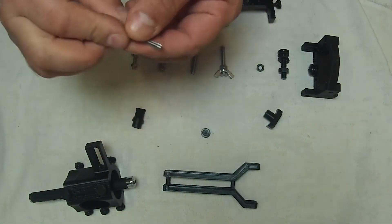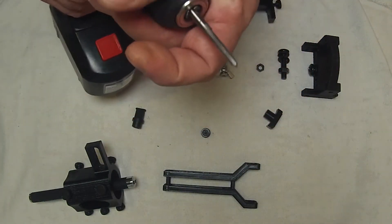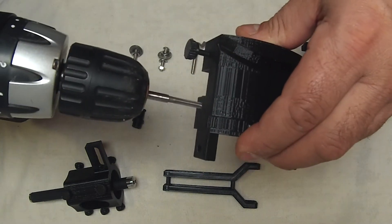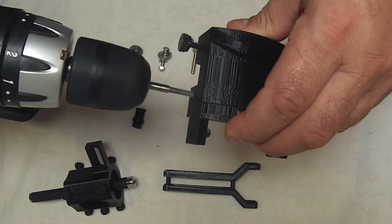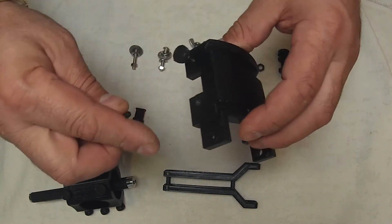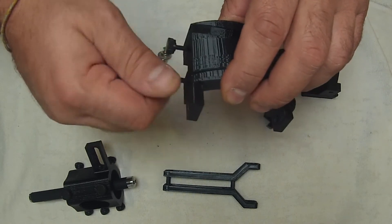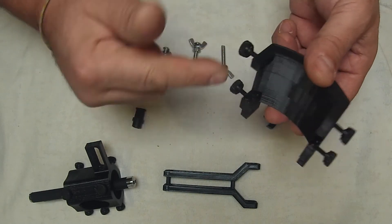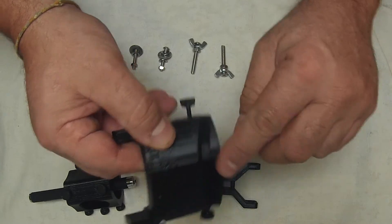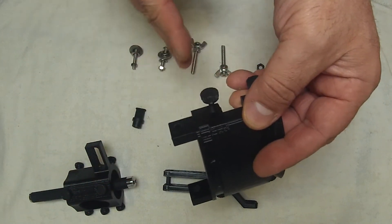If you're careful, I just put the tap in my little handheld drill and very carefully go straight in a little ways and straight out a little ways. You don't leave it hanging there to strip it — you just zip in and zip out. Done. Then when you put the 4mm hex head with the thumbscrew cap — which I'll include a 3D print for, somebody else's model but I use them all the time in astronomy — it all comes together nicely.